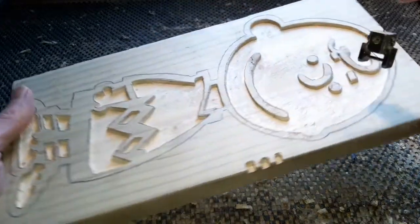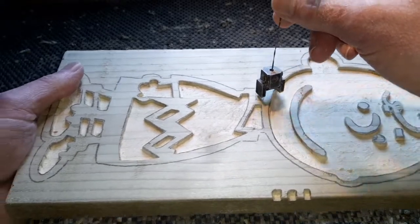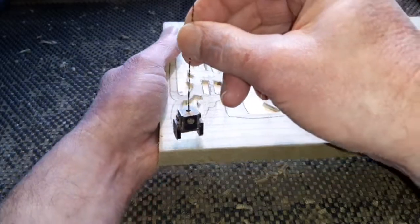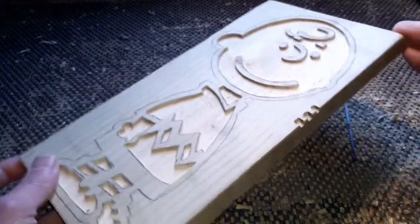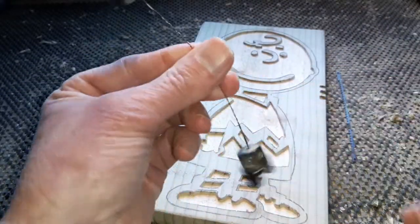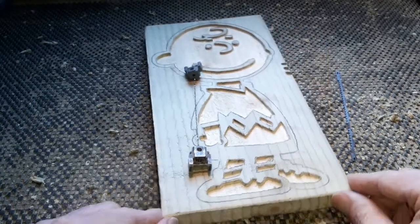So I do a spiral blade, and literally we can just come in here and just move your wood like that along and down and that way afterwards. So basically you could cut this small little project out like this without turning the wood the once. Okay, you'll see as we go along. I'll pop this into the scroll saw now and we'll literally cut this out before we start cleaning it up.